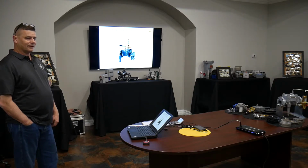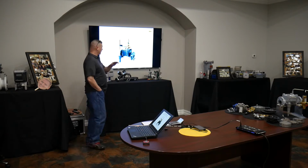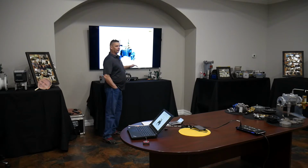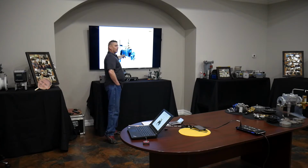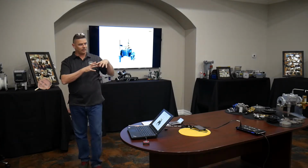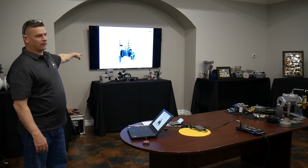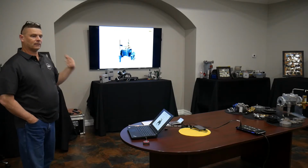The body. Because on an old standard port that hasn't been converted yet, it has the body, a spacer plate, a throttle plate, and a spring case. You've got 3 layers on the cake. When you transition it over to large port, the throttle plate's rounded and the spacer plate envelops it. So you know right from the road whether they've converted it over. Okay? What else do you know about it?